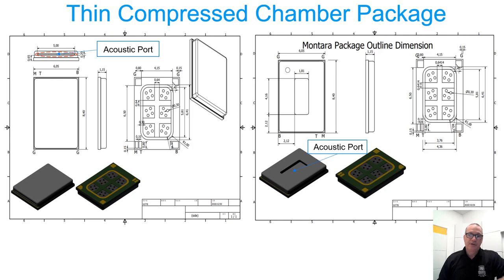One of the benefits of the semiconductor package is it's very robust — SMT reflowable with a metal lid. The metal lid can sustain compression force, which is common when positioning transducers into acoustic cavities. There's usually PSA or elastomeric material needed to make an acoustic seal, and it's no problem to have the top of the package pushing against that material to make a seal, or to take adhesives so it can be glued into place.